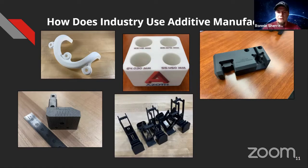How does industry use additive manufacturing? We have mold cavities for urethane, work holding for managing arbors, assembly jigs for major OEM automotive lines, grippers for tier-one suppliers that go on the end of robots to manipulate parts, and components for medical machines in nearly every hospital in the US. It goes from end-use components to prototype components to tool storage on a bench. We didn't need CNC setup time, and we're able to part-mark or put logos right into the part — underneath the layers of material so it doesn't wear away.